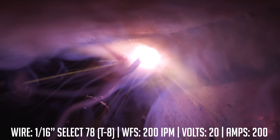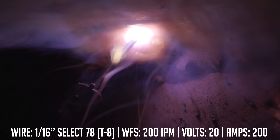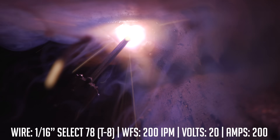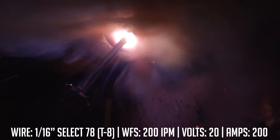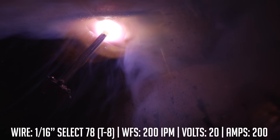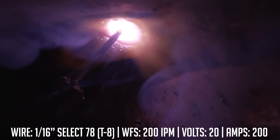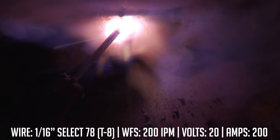After the third pass I think I've got it down — running pretty smooth. Just a little bit of a wiggle, maintaining a good consistent travel speed. Travel speed, contact tip to work distance, and work angles are your biggest keys. Watch the puddle as it flows in, make sure bead placement is good, and do a slow steady push. You get good depth of penetration and good weld deposition — it's good for seismic applications, bridge work, heavy structures, and cyclically or dynamically loaded applications.